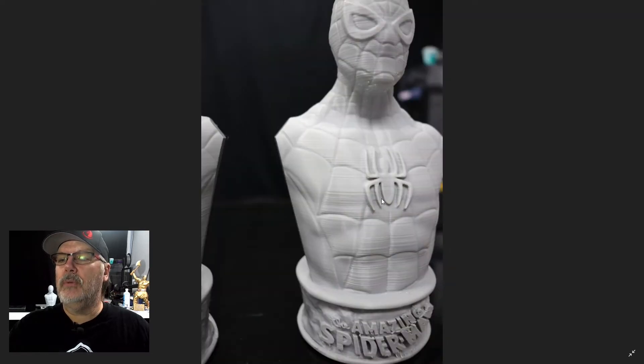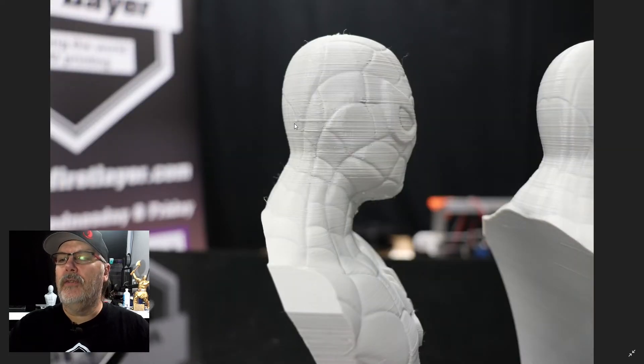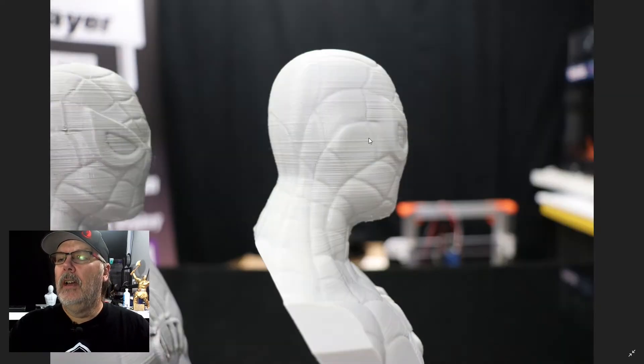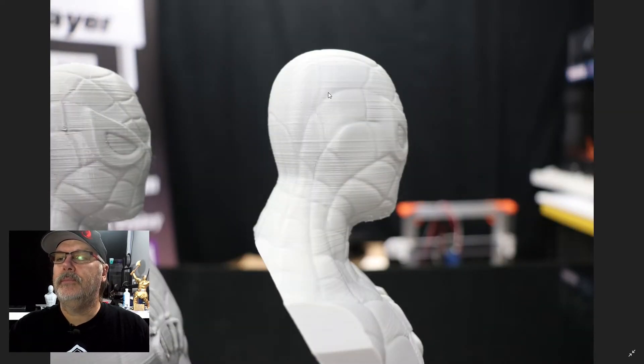Let's go to the next one. And we can see those aberrations. This is the first print, and this is the second print — we can see they're in the exact same place. I do believe this had something to do with the TL smoother, not necessarily the settings in Cura. We see the first one here. You can see the lines a lot closer. You can see there are little areas where there's a little bit of under-extrusion. I think that's from the start and stop points more so than anything else. And those lines are in the exact same spots.